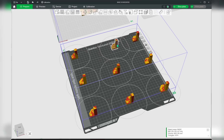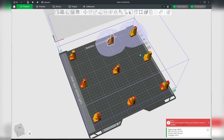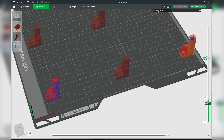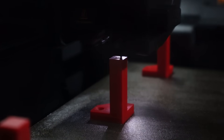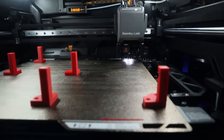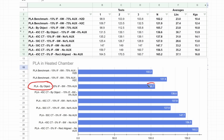One suggestion from the previous video really stood out — print by object — a technique I actually tested years ago as a great way to get better-looking prints on slow printers. I've never used it on any of my Bambu printers, so this is a first. It prints one object at a time, keeping that part a little warmer and not moving away until it's finished. There is a trade-off: you can't fill the build plate and it has to slow down to avoid overheating. Testing in a vented chamber came in at only 87% of the strength of the standard benchmark parts — not good results. But in a heated chamber, the results were quite a bit better, coming in at a 12% improvement on the benchmark.